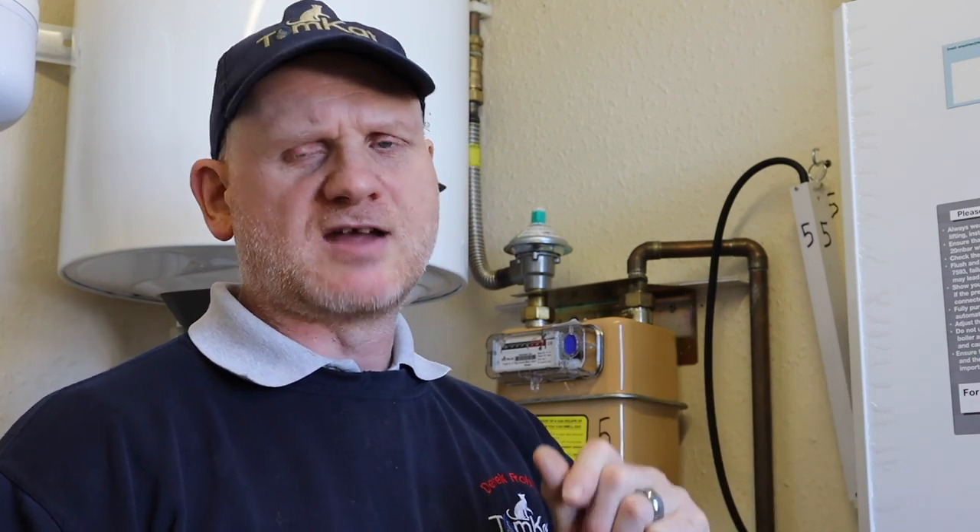Now let's gas rate central heating. What you don't want to be doing is start gas rating as soon as you turn that boiler on, because that will just give you your maximum on central heating load. You need the boiler to work a little bit to give your actual load for the heating — run it for about five minutes before you start gas rating, to give the boiler enough time to settle. That will also give you some idea if you wanted to range-rate the boiler. Again, wait until we get a full figure, start the stopwatch, time for two minutes, take the second figure, and then let's do the maths.